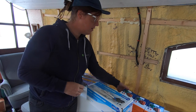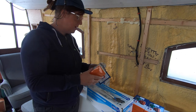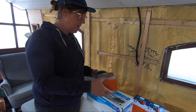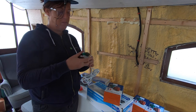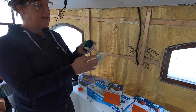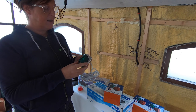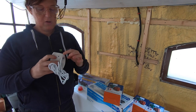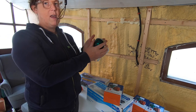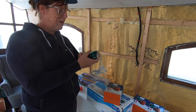I also have the start of the nav lights. I've been looking for navigation lights for a long time, trying to find ones that look right, and I've finally found these ones. They're eye-wateringly expensive — about 60 quid each — but they are on the outside of the boat, they will set the boat off, and I think they're really lovely. They're LED lights; obviously you've got the green and red side navigation lights, and they'll go on the side — I need to drill a hole through the side of the boat and then they'll sit there and look beautiful. There's also exactly the same fitting as a solid white stern light that will go on the back of the rudder. I'm really, really happy with those and I cannot wait until the first time I can turn all the nav lights on.